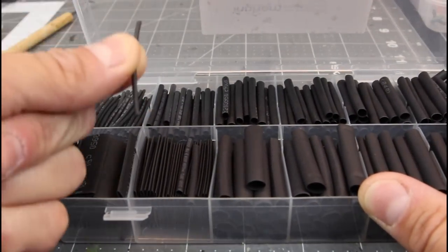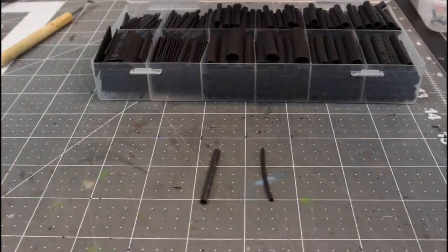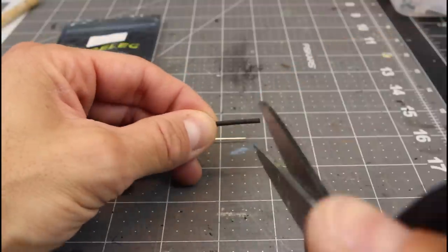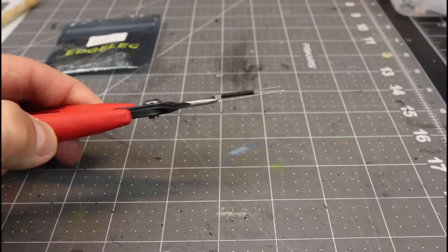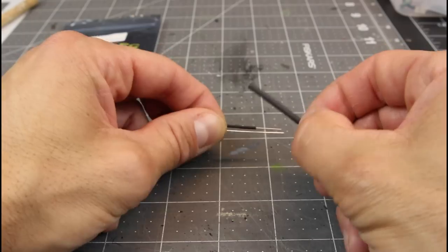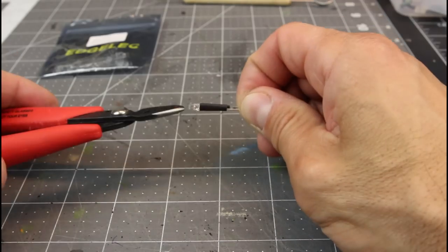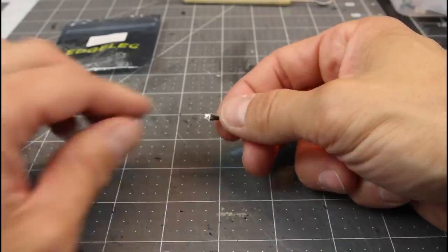Now we're on to the mushrooms. This is some heat shrink tubing — we need two sizes. I picked a whole bunch of different colors. I'm going to tell you all the things I did that I wish I'd changed. You want a very short stem to this mushroom — I would shrink it up even more and make the wire leads longer. It's going to make it much easier placing these leads over the batteries when the build is complete. Just be careful, the leads do get pretty hot, so let it cool for a minute and you should be all set.